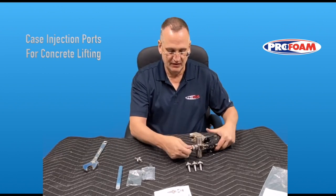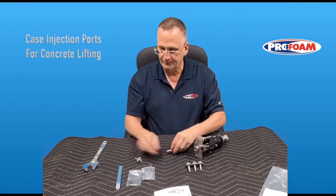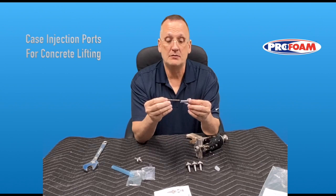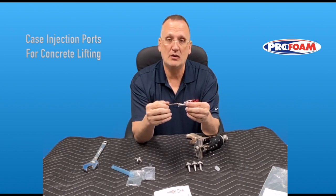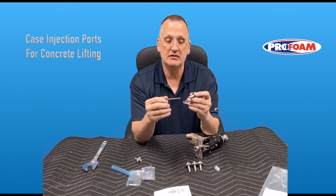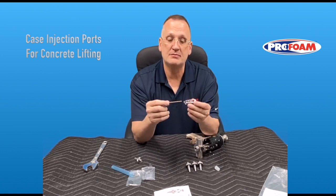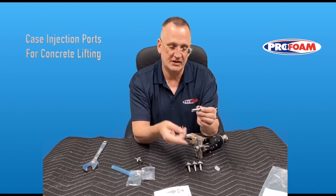Once you have a couple of tips with foam in them, take the cleanup bit and put it on a cordless drill. Drill through from the tip end — go about a third of the way, pull it out and clean the foam off, go another third, clean again, then go all the way through. That keeps it from binding up inside. Once it's clean, you can use it over and over. If the seal stayed on, you can reuse it too — if it stays in the hole, re-drill it and put another one on. And that's about it — it works for a long, long time.